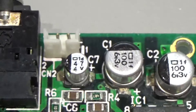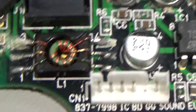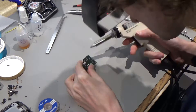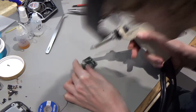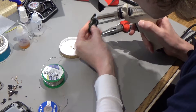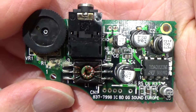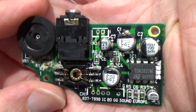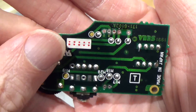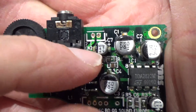So there's five caps on there and they've all leaked. The hard part is probably gonna be getting them out without melting these connectors because I'm gonna use the hot air on it. I might have to take those two plastic connectors off, just to minimize any kind of damage. I've just taken the two plastic connectors off — one for the speaker and one for the sound coming in — just because I don't want to risk melting them when I get the hot air on these caps.